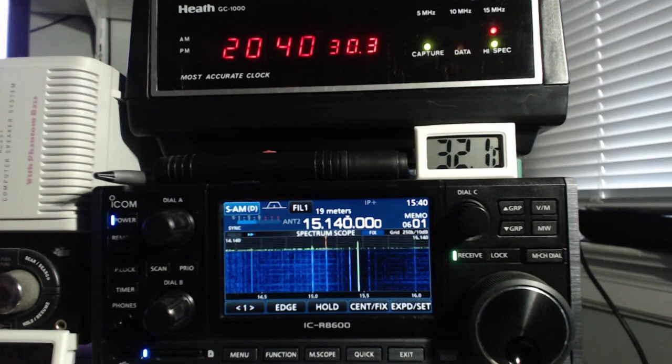Of course, if you happen to be a really rare DX station, you're going to be able to make many contacts regardless of the choice of power. The rule of thumb is well known to DX QRP operators at CO2KK, whose students were operating at CO4CL many years ago: a station at a rare DX location adds about 10 dB to the readability of the signal. Physics and mathematics don't strictly support this, but it's purely empirical — folks will listen more frequently and more intently for a rare DX station.